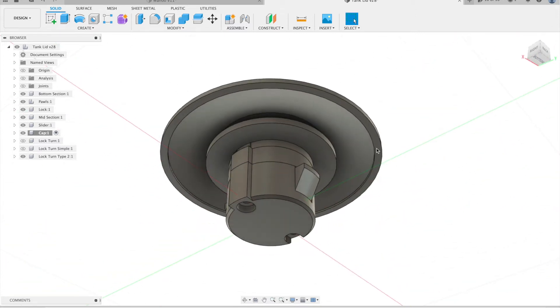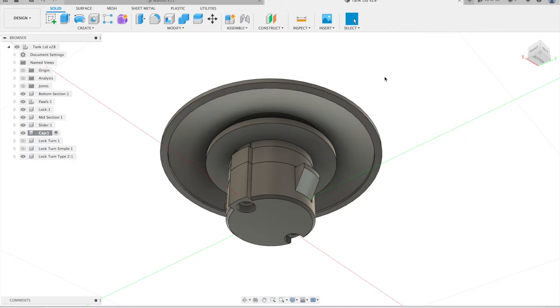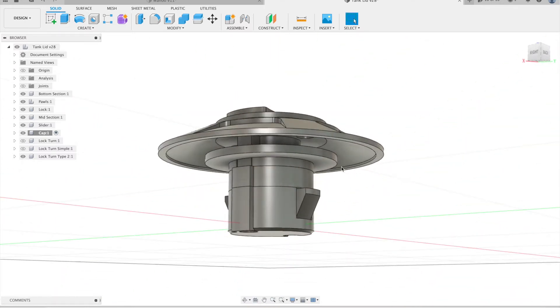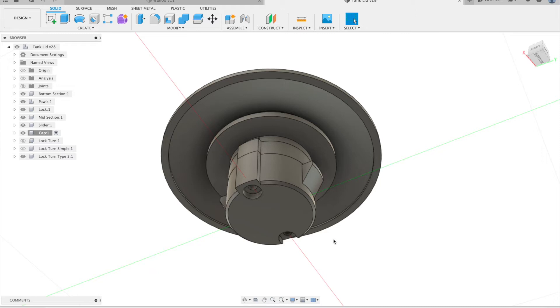I had to design it a bit differently for a 3D print — this gives it a bit more surface area to stick onto the build plate. The nylon isn't too bad to print with; I've not had any warping issues with it. It just prints similar to PETG. There are a few considerations I had to make in this design — there's quite a big support structure underneath this tank cap, but it all seemed to come off relatively easily. These smaller holes for the screws to be recessed into did need support, but again it was very easy to remove.